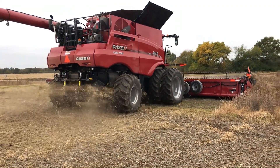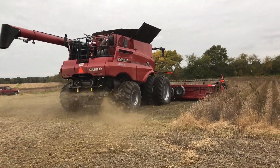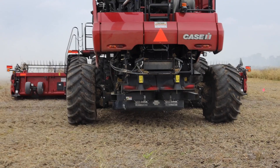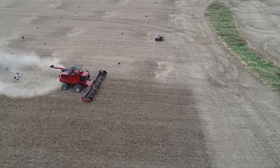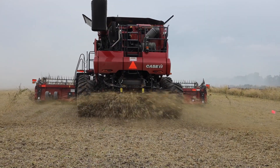Based on our data, you're going to lose about 20 to 22 percent to what we call header loss. So of everything out in the field, about 20 percent is not going to enter the combine. Of the remaining amount that enters the combine and goes into these devices, based on our research, 94 percent of that seed is ground up and rendered non-viable. So a very high percent of what actually gets into the combine will be ground up and no longer viable, and you can see substantial reductions in the seed bank the following spring.